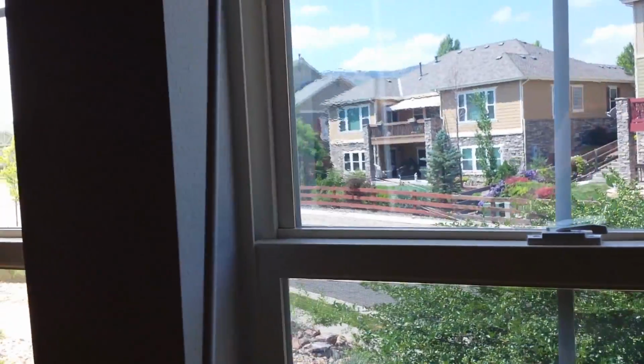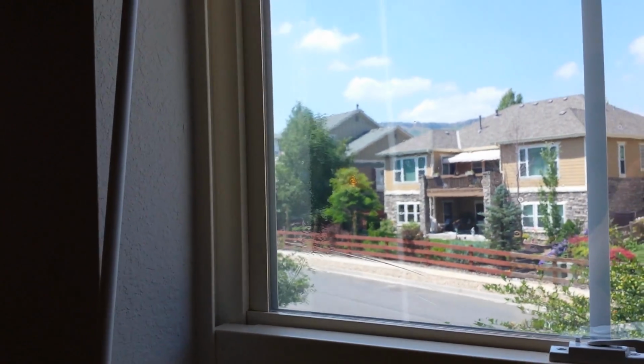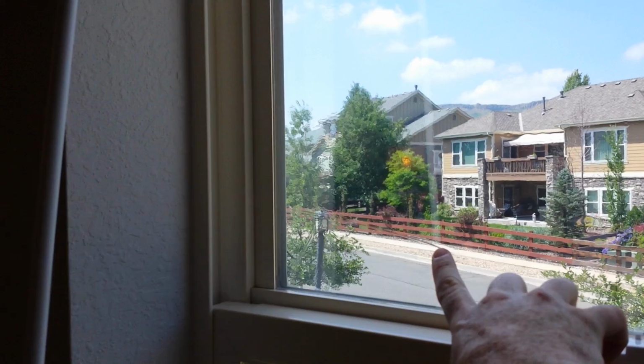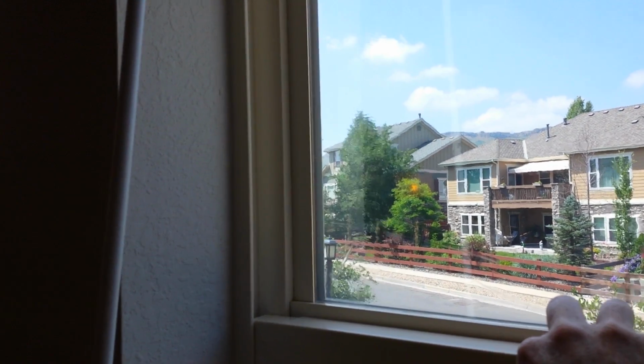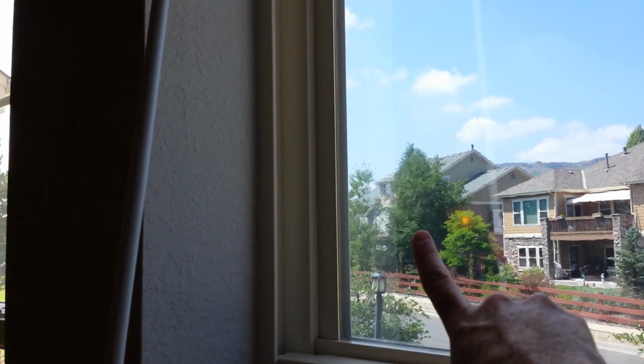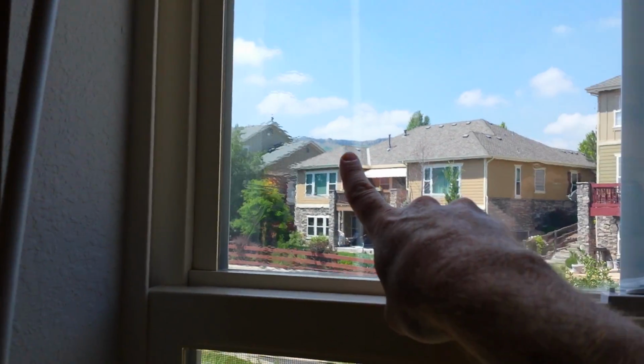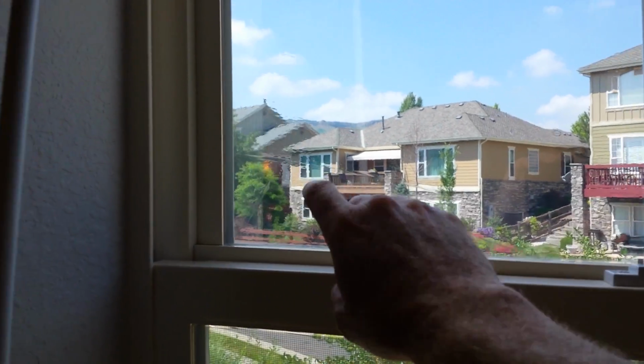you an example. The typical patterns that you're looking at are either a strong crease. This is one that would be defective, and I typically take back. So a strong crease that cannot be simply pressed out. Okay? The other thing is, you may be able to see as I pass through, you see these little bumps here. That's just from the machining of the film.